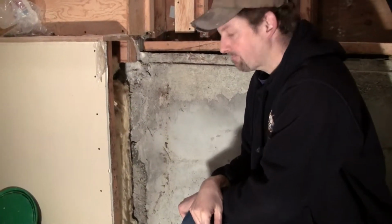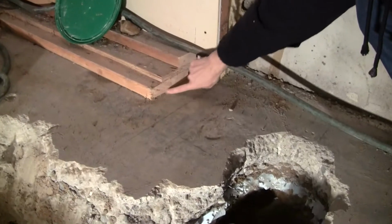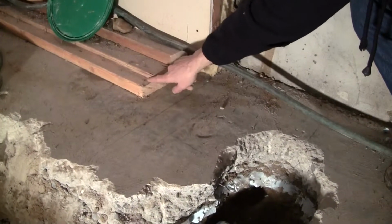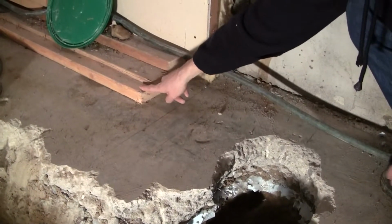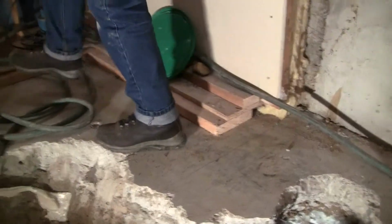And show me what happened to those 2x4s on the bottom. Right, so what happened here is that the 2x4s, the subfloor, was just laid right on the concrete, and then they decided to put a vapor barrier over that surface with the subfloor here, and you can zoom back over here. You can swing that light around a little.